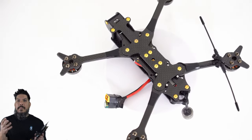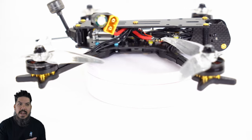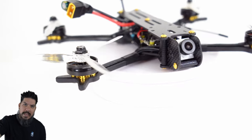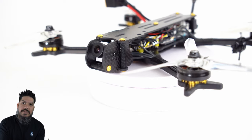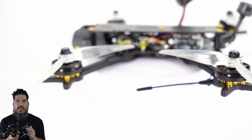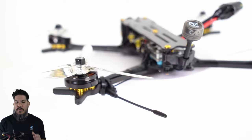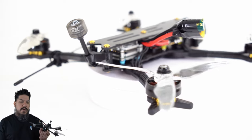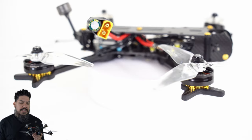And if I am not going to carry a GoPro, then I can deal with a lighter motor and reduce the weight. So my benchmark for what feels good to me is 2207 or 2306, around 390, 400 grams without a GoPro. So when I add that action camera, I get larger motors. By eliminating the action camera, I can get slightly smaller motors and reduce the weight and actually get a more punchy feel. I didn't expect that this was gonna just rocket me to the moon. So man, losing that 80-ish, 90-ish grams really makes a substantial difference, especially when you pair it with a slightly smaller battery. You get a weight in the end that is so far reduced. The fun of this is just exceptional.